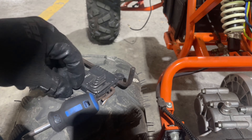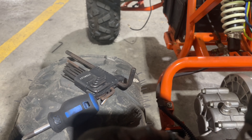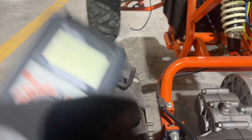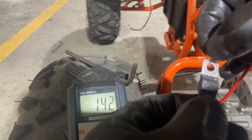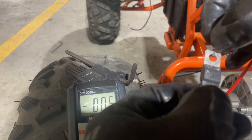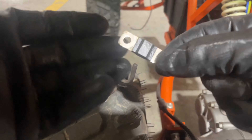I've got my multimeter here. All you have to do is put your ground on one side and your power on the other. My multimeter is a little messed up, but you'll see what I'm talking about. You see it's marking zero or one there, but as soon as I touch both ends it shows me the power has gone through. Back to one, touch again — so I know power is running through that fuse. My poor multimeter. We know this fuse is good. If you check continuity and it's good, you can put it right back in.